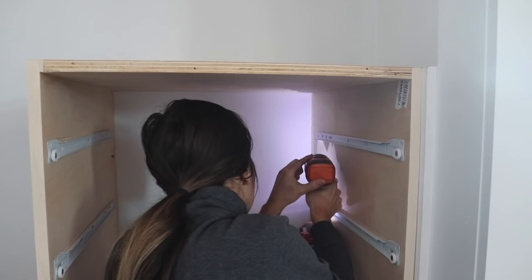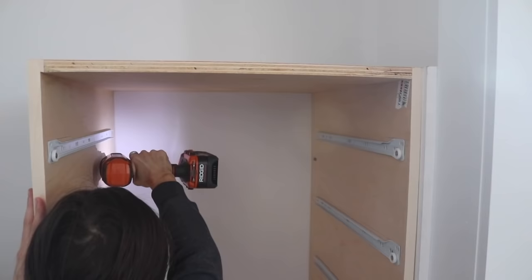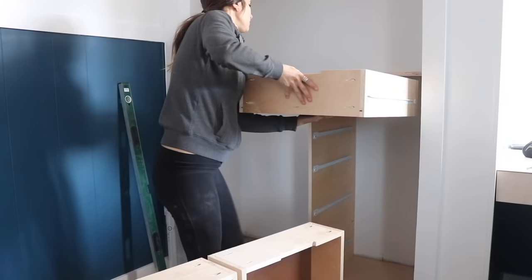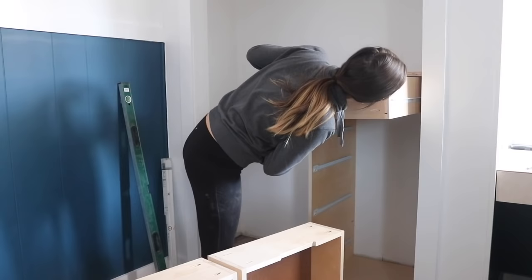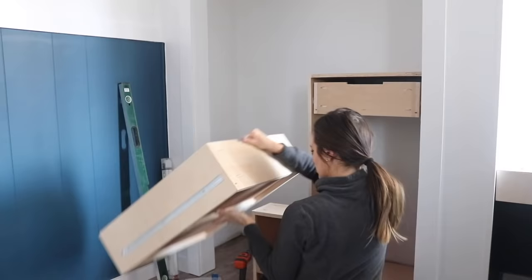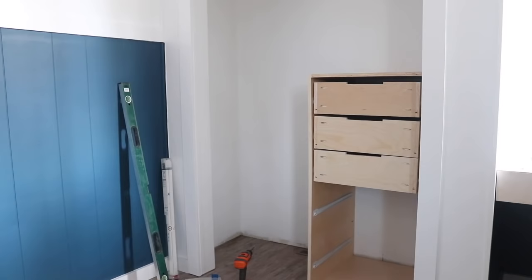I also had this little piece of white trim I added along the opening — the jam where the closet doors used to be. This is just to bump the built-in drawer system out from the jam a little bit, because the jam itself would interfere with the drawer fronts if I was letting them come up flush, so I had to give it that little extra space. Now I'm putting the drawers in. You might be wondering why there are notches cut out of the top three — it's because I needed that for the hardware I'm going to be adding onto the drawer front; it just needed a little more clearance for the screws. I did that just with a jigsaw.